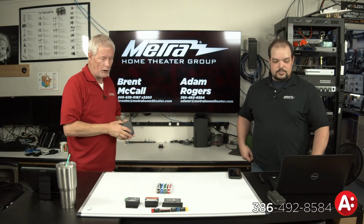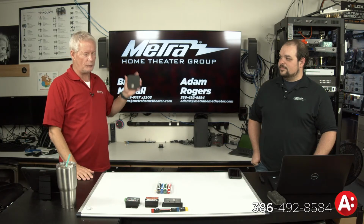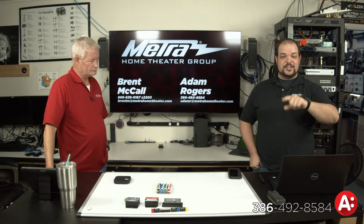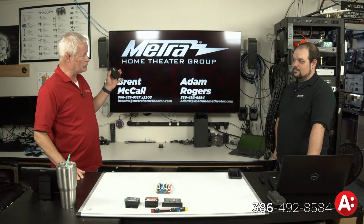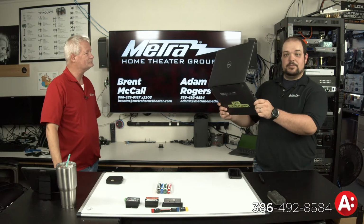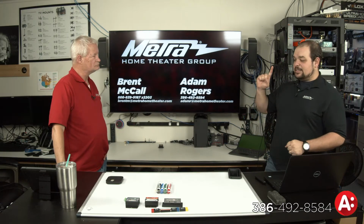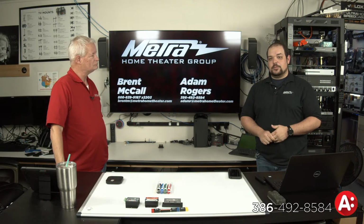So again, step one, find out: is your display working? Have a source. Do not bank on whatever's on the job site working correctly. By the way, the recommendation for the Fox and Hound came from the experts. Thanks, guys. I see your comment in here. Appreciate that. So know that you can test the system. Inexpensive, fits in your toolbox, put some content on it. Or a laptop. Really simple, really straightforward. Most laptops that you pick up nowadays, especially if you're doing automation programming, you'll have a laptop with you. And if you are doing anything that has anything to do with the network at all, you should have a laptop with you.